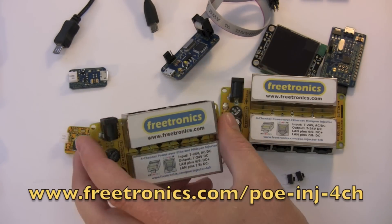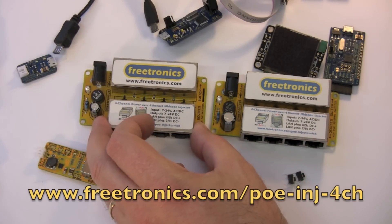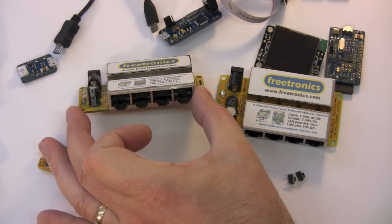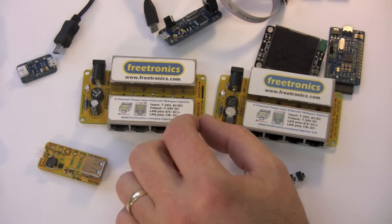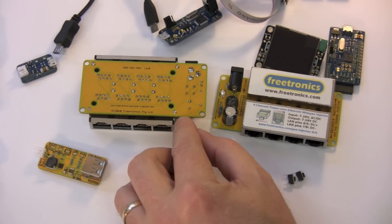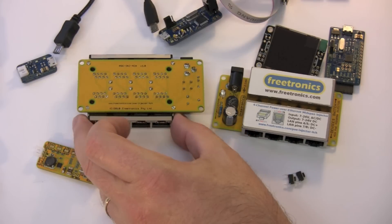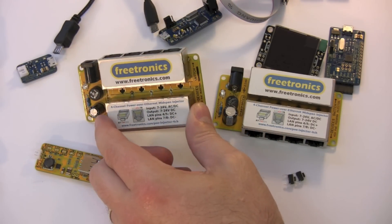This is a Power over Ethernet mid-span injector — two of them. The one on the left is the first one that we had fabricated. I laid out the design for the PCB and sent it off for fabrication — I think I had 200 or so of the PCBs manufactured. These four-way RJ45 jacks were a new part we hadn't used before. So even though I went over the datasheet and measured everything, I still made a mistake laying out the footprint. This part has two little plastic stakes and some metal pins. The metal pins are soldered in place to give mechanical strength, and the plastic stakes give strength as well. I got the offsets wrong, so I had to cut off the plastic stakes and cut off the pins in order to make them fit into the hole and get all the connector pins lined up.